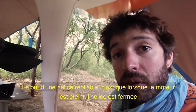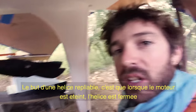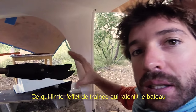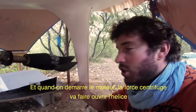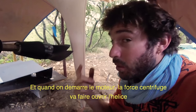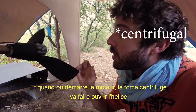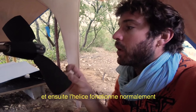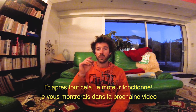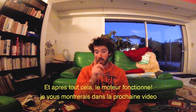So the idea with the foldable prop is that when the engine is off, the water goes around the prop and doesn't create any drag, and when the engine starts turning, the centrifugal force, whatever it's called, pulls the prop open, and then it can work properly. I've been building the berth, I've been installing it, and it's actually working. I'd love to show you this in the next video.